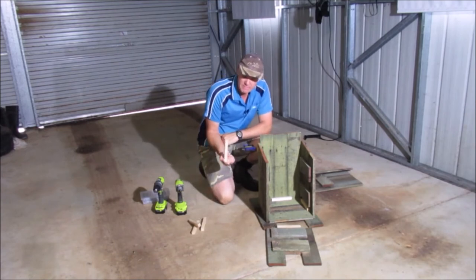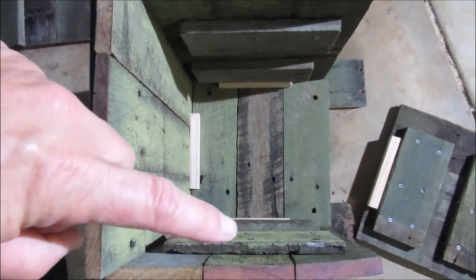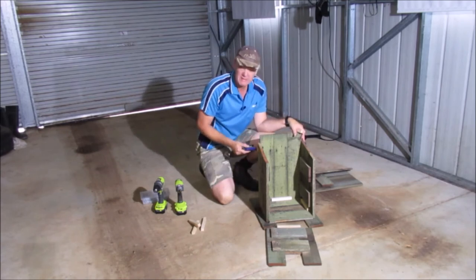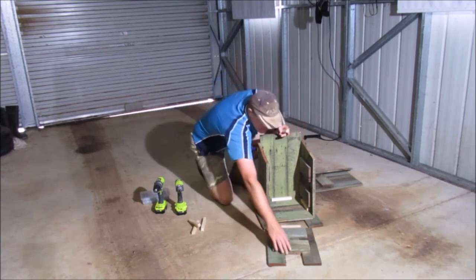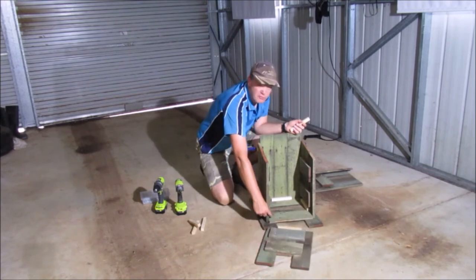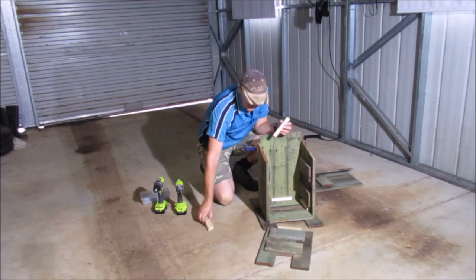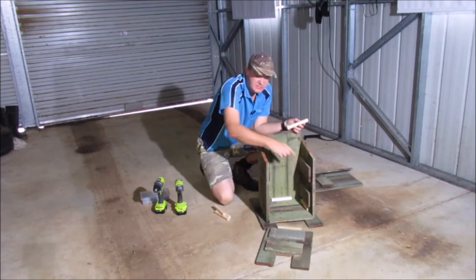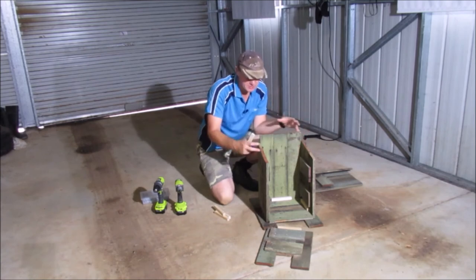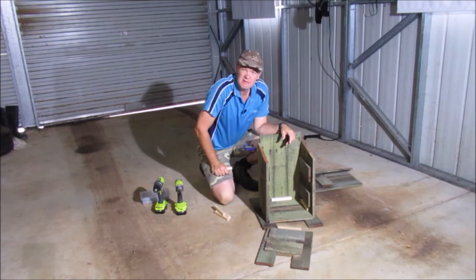I've bought some small square timber to help attach it all — I've put four pieces on the bottom and I'm going to screw through the sides into them and also from underneath up into them as well, which helps support it. I've also cut the entrance hole in the front so the possum can get in and out. I've drilled four small holes in the corners of the base so that if any water does get in it can drain out. I'll use the remaining four pieces of timber on the sides, gluing and screwing them on while the clamp holds everything, then lay it on its side to attach the bottom.